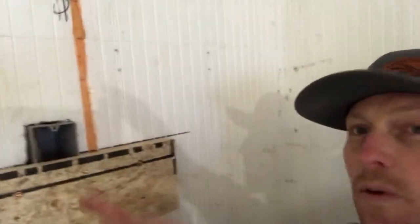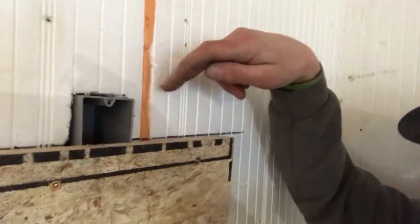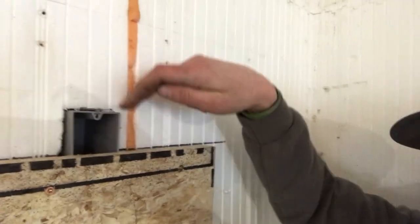I've got a gap back there that I spaced it out. What we're going to do is spray foam in — we're going to notch all this out a little bit deeper around this, and then spray foam all through there. When that spray foam hardens in around the plastic molding of the box and the nail brackets, it adheres to the box really well. Once they sheetrock, the insulation dries, hardens, and these boxes will never go anywhere.